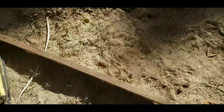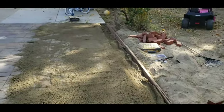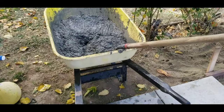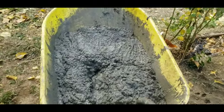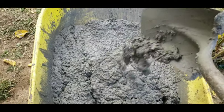We'll go ahead and change it. I put everything around and make sure I leave everything where I'm going to need it as we go. Sometimes I do the projects by myself. This is how I add the mud out here — this is how I make the footing. I added a couple extra trowels of cement, plastic cement, to my regular Quikrete and a couple scoops of sand to make it a little stronger since it's a border.